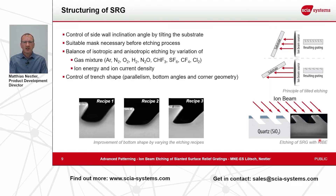To achieve a certain quality of these surface relief grating shapes — the shapes of the trenches — you have to balance different parameters of your ion beam process. These parameters can be parameters of the ion beam source like the beam energy and the beam density, but also the proportion of reactive gases that are used to etch the materials while the mask shall resist the etch.